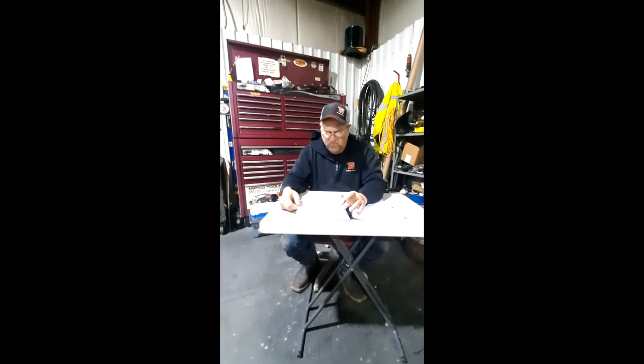Hydraulic oil specifications, hydraulic grease specifications. You got a different style of grease for the rotary drills than you do the percussion drills. The percussion drills get a lot hotter than the rotary drills, so it does require a different style of grease. This grease is major important. It has got to be specified, and it's got to be right, or you're going to buy a lot of parts. Attachment troubleshooting.